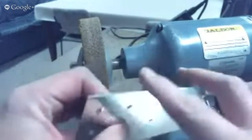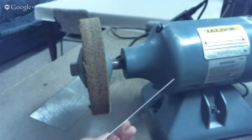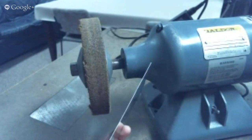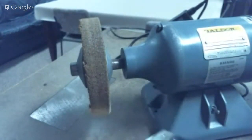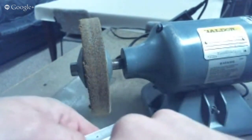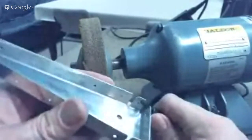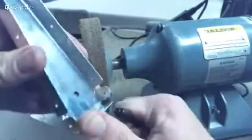As long as you just quickly take care of the edges, you're not going to have problems. If you work it and work it to be perfectly smooth, you're definitely not going to have a problem, but it takes a very long time to get every surface to look like that. Especially in places that are on the inside of a double flange, you just can't get in there. You can use the hooked deburring tool and get down in there and drag it around the corner, then come back with Scotch-Brite and drag it through there — that's about all you get.